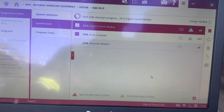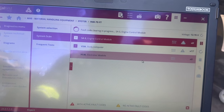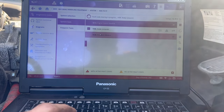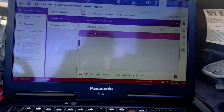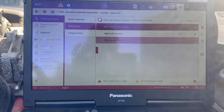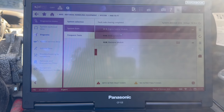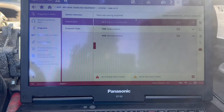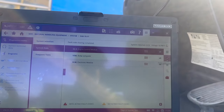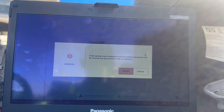It's going to take a little while, but basically it's going to go through every system that we've scanned and clear all the codes. Once it's cleared all the codes, we can restart the scan if we want to double check, or we can go back and log off, run the machine for a while, then do another scan to see if everything has been cleared. Fault codes clearing has been completed, and then we're going to restart the scan.